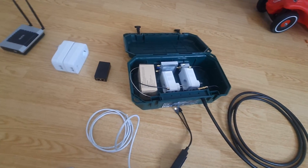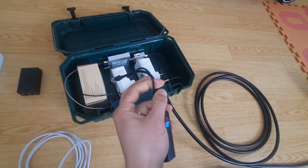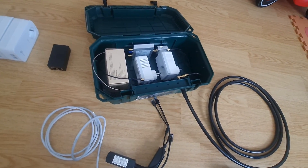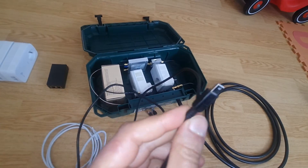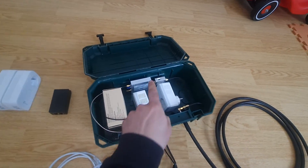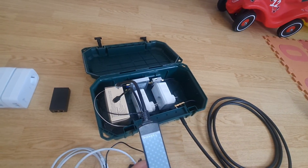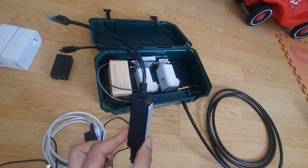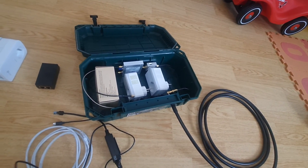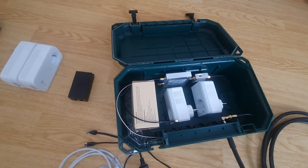The fourth splitter will power the DC injector — I'll cut the ethernet cable and replace it with a micro USB cable, giving 5 volts to the amplifier DC injector. Each miner will have 5 volts from its own individual PoE splitter. It's very important that each miner has its own power supply for stability, and if something goes wrong in the future you'll immediately know which device has the problem.